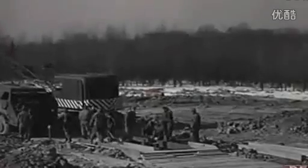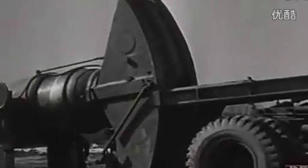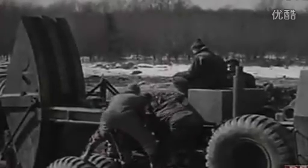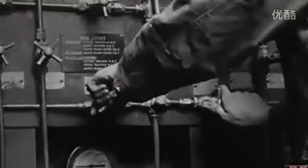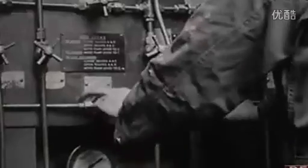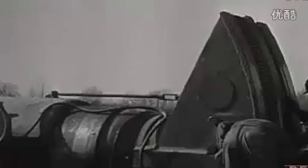A timber runway is constructed, enabling the 40-ton tube to be driven directly onto the base. The trunnion supports align with the trunnion jacks by use of a built-in cross-feed screw. A hydraulic pump and valve system within the base raises the jacks which lift the trunnion supports, permitting the carrier to be driven away. The jacks are then lowered and the tube drops until the elevating rack is engaged with the elevating pinion.